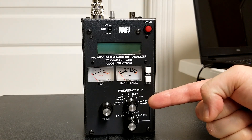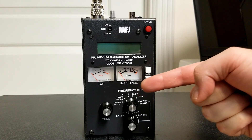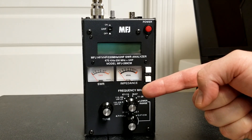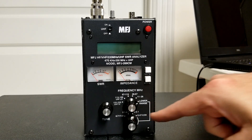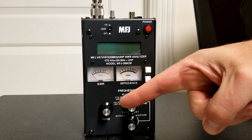We also have some knobs down here at the bottom. We have our selector knobs for HF frequencies — the upper range of HF gets into 11 to 28, 28 to 67 megahertz, and so on as you go across the dial. In the bottom section, if you turn this little dial to the lower range, you can actually get into 160, 80, and 40 meter bands to dial in your frequency for those longer wavelength bands. This allows you to adjust for a broad spectrum of bands, both HF and UHF. And then you have your tuning dial right there — with this little knob you can tune the frequency to find where your lowest SWR happens to be with the current setup of your antenna.